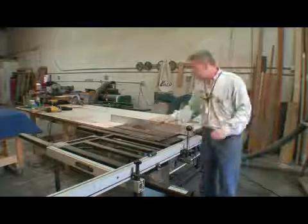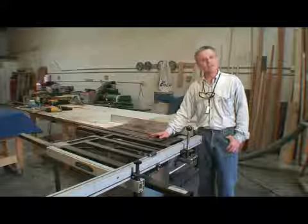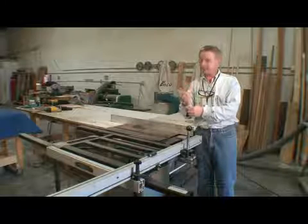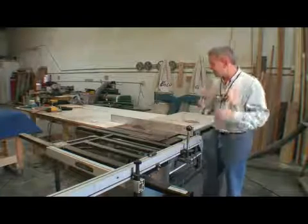First thing, always make sure that you understand how the table saw operates and what's safe on it and what's not. Remind everybody who uses it about the long sleeve shirts. If they do have them, make sure they are buttoned up. Safety glasses always, at any given time.